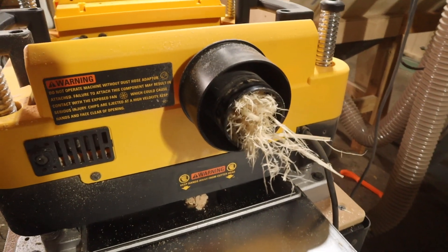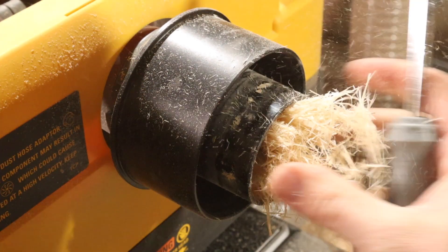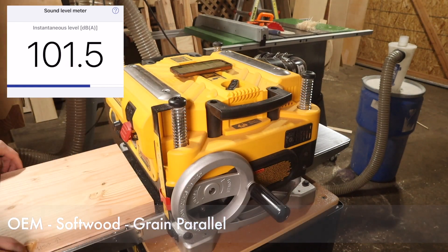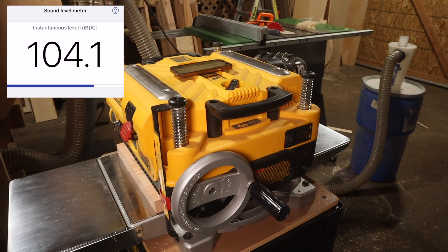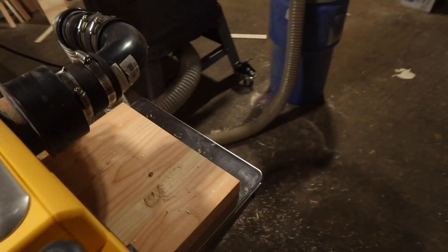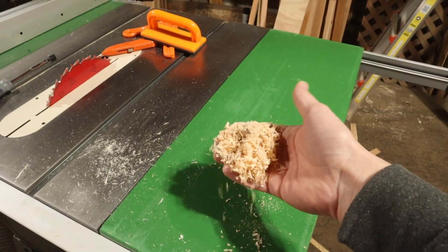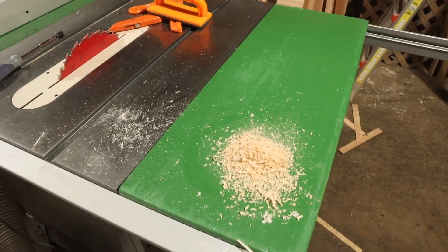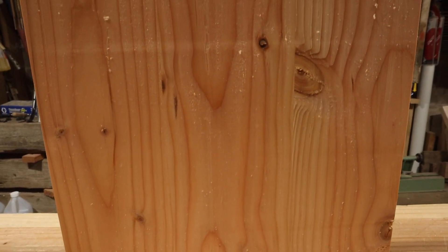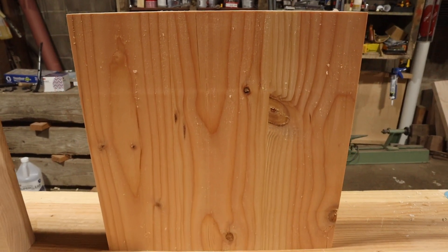OEM blade, softwoods running the grain parallel, one quarter turn. Overall not that bad and definitely what I'm used to. A little bit of chips in the front, a little bit in the back. The chip quality is really fine, sawdusty-looking stuff. For tearout it looks remarkably similar to the maple — tearout in the pulpier sections, but when you hit the rings it's pretty consistent. You can see a little bit of that blade damage making its way into the cut as well.